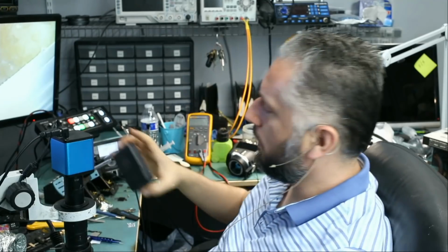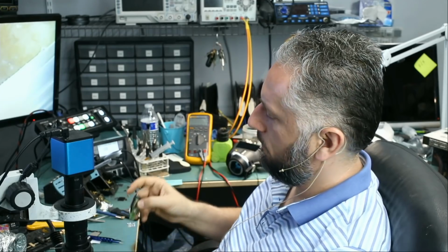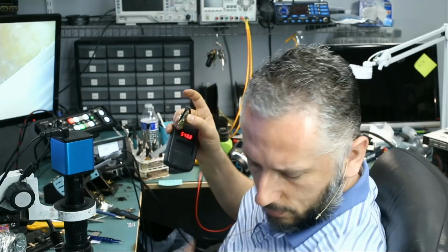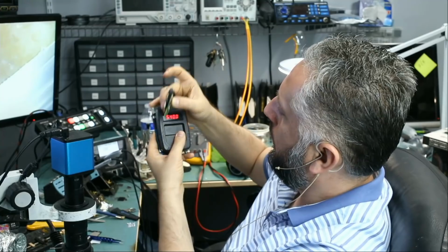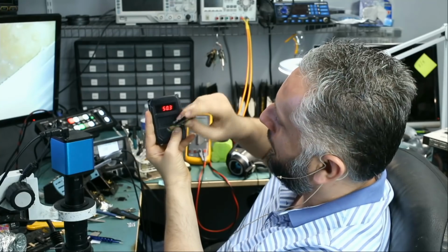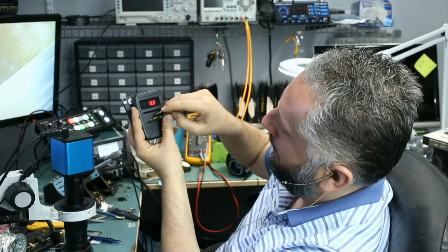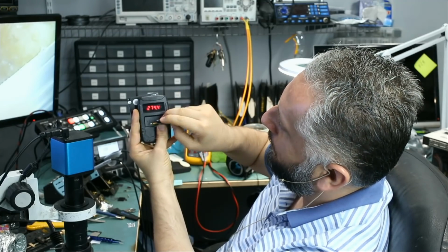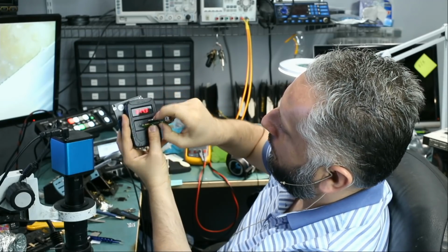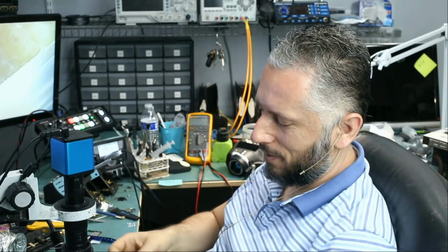We're going to use our fob tester to make sure that we get the 314, 315 frequency. Before we got a 0. This is interference right now. Let me put a hard drive on the back. And let's see. Look at this. 314.9. And button number 2, 314.9. And button number 3. Let me make sure the battery is properly aligned. 314.9. Awesome. So we were able to fix this fob for the customer.